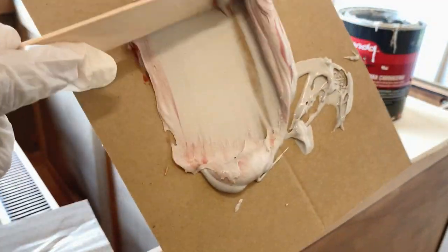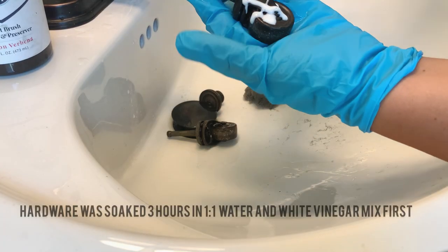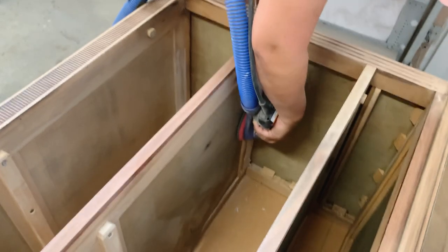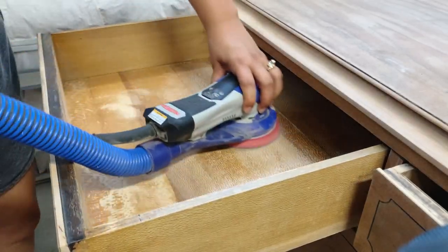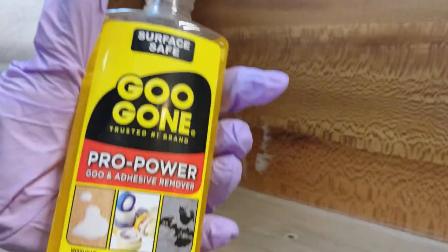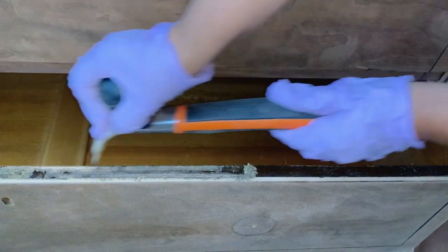The runners on this dresser were really worn out, preventing the drawers from sliding smoothly. I'm making them flush using Bondo — I'll talk more about Bondo later. While Bondo dries, I'm scrubbing the castors on this dresser; they had been soaking in a mixture of water and vinegar and I'm using steel wool and Bar Keepers Friend. An hour later I went back and sanded the Bondo until smooth, tested the drawers, and it definitely helped. The inside of the dresser also needed a good sanding, so I took my time with each drawer. One drawer had paper really stuck to it — I removed as much as I could by hand with a spatula, then used Goo Gone and a scraper to remove the really stubborn finish stuck to the drawer edges.